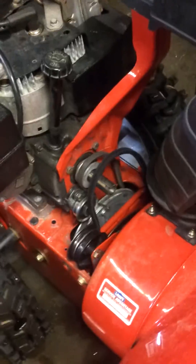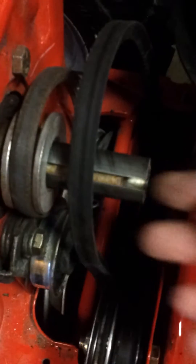They don't want it anymore so you take the old engine off. You'll notice the PTO is quite a bit longer than these old engines. So what you got to do is get on eBay. This particular one took a half-inch to seven-eighths-inch sleeve — cost about $20 and the guy had it here within a couple of days.